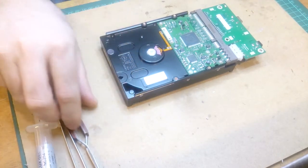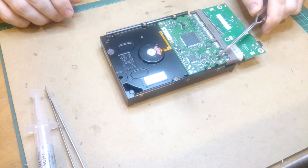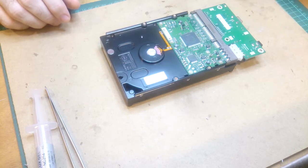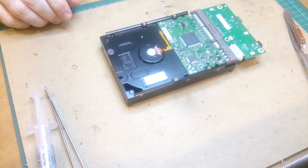What we'll do is remove this component here — the one that burnt me — and hopefully the drive should spin up. The nice thing is we can actually just remove it and don't even have to replace it for the sake of getting the data off, as long as we make sure our power supply doesn't give any more voltage surges. Let's get to taking this off and hopefully we'll be good.